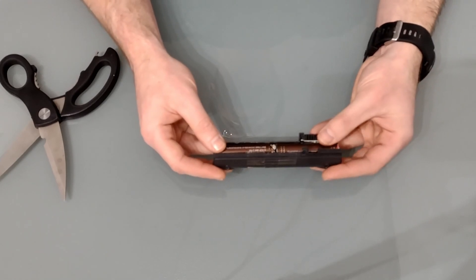Before we move on, let's talk about batteries. The rising popularity of 18650s is a double-edged sword — they're readily available but there's also a huge market for knockoffs. There are literally millions of knockoff batteries available to buy. Some knockoffs just have exaggerated capacities, like a mini spotlight battery claiming 6800mAh — that's not possible, and the cell doesn't weigh anywhere near enough for that capacity. It's likely actually an 800mAh cell with a six printed in front.